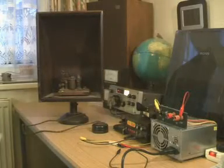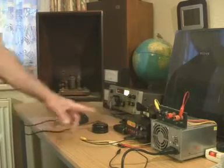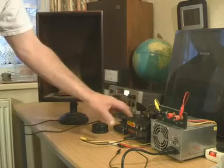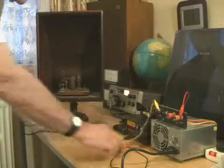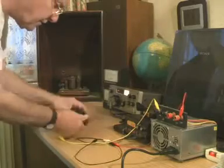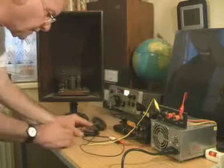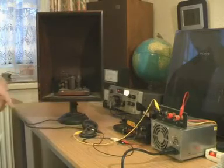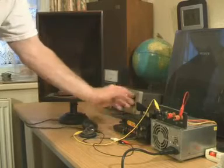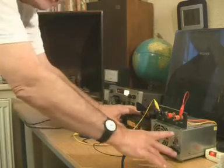Here's a little setup so that we can demonstrate this to you. Here we have a power supply from an old computer, and it goes via this, which is a memory keyer. It's very old but it does have a little memory for doing Morse code. And I shall connect the wires to the input of this relay like so, and then trigger off the keyer, which sends out a general call — especially if I switch on the power supply.